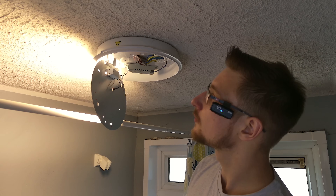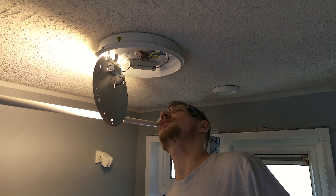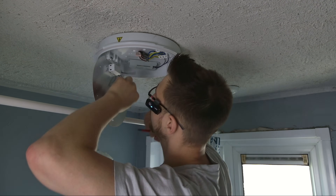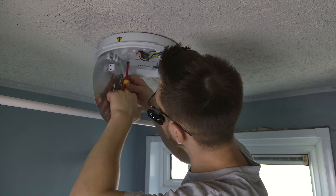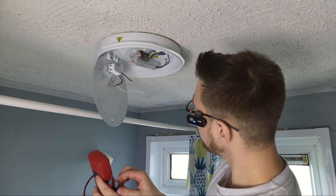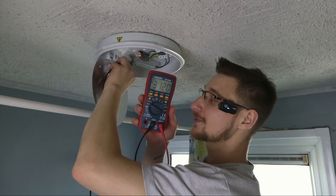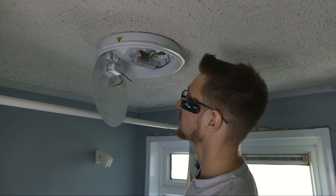Let's turn the light on. Oh, this camera does not like this light. 50 to 60 Hertz should be fine. All right, let's turn that off and disconnect the LED panel — that might make it easier. There we go. I now have to just remember that this is all live right now. Let's undo the screw and grab my multimeter. Right, so this is ground, this is plus. Ah, look at that — 31 volts. I can negotiate that down to 5 volts. Sounds like I've got a plan.